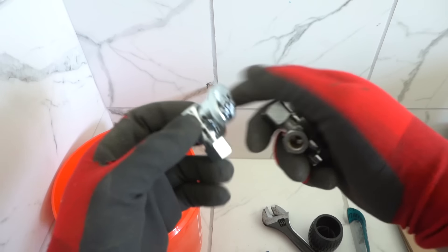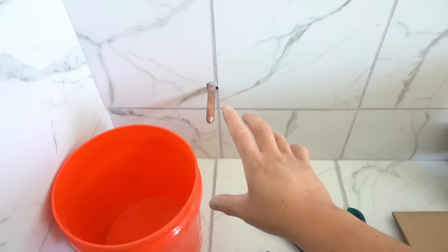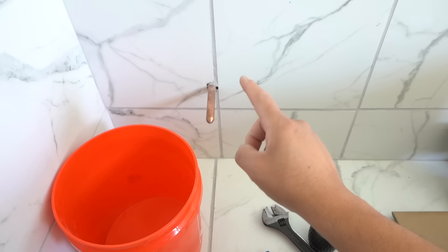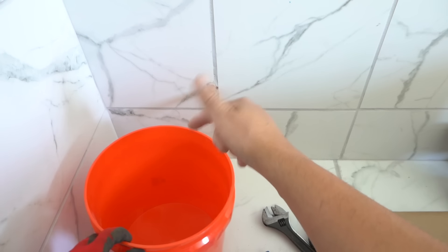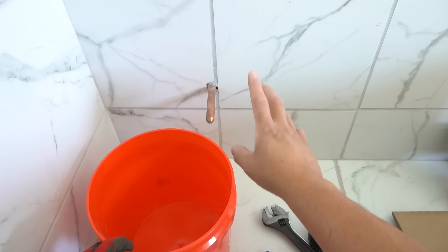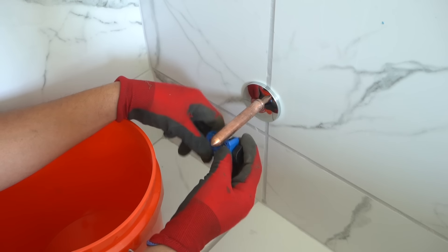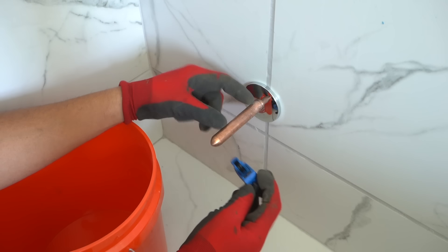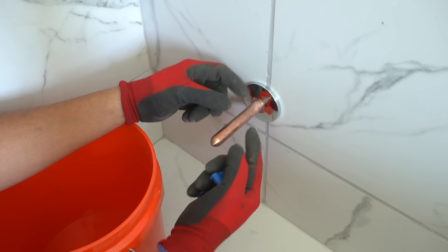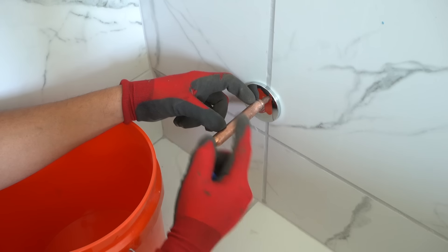We need the plate, and more importantly, we need the compression valves. If you need any of the tools I use in this video, I'll leave all the links in the description down below. First step: make sure you shut off the main water line to your house. After you shut off the main water, go to one of your sinks and turn it on and let all that water drain, because if you don't, once you cut this open you're going to have a lot of water piling into this bucket and you might have an overflow situation. This is a half inch plate — it's going to go over. I'm going to cut the copper around this area. I want to leave some copper for the next homeowner, just in case they want to do some renovations, so take that into consideration when you're cutting your pipes.